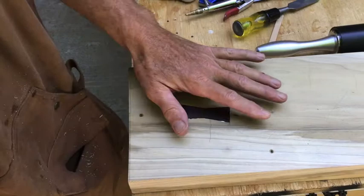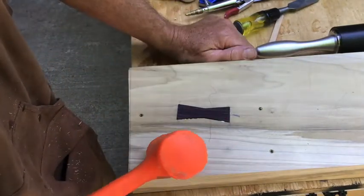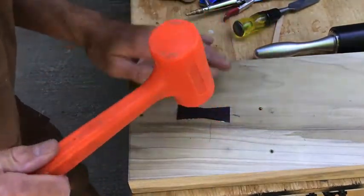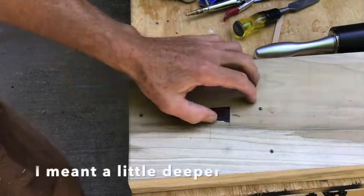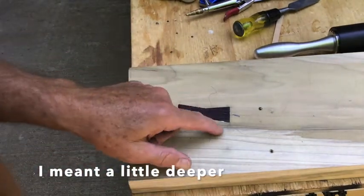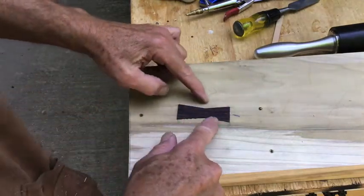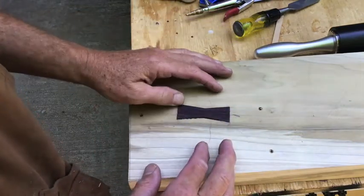Now, if I was using a fragile wood, I would keep the wood on top, but this is king wood, which is really tough wood. So I've got it seated. It's just slightly a bit proud like I wanted. I probably could have gone a little bit less on the router. Now, something that if you got a gap that you're not happy with, go ahead and get your iron out and steam this. That'll swell up the wood, help it come together, and the glue will hold it.